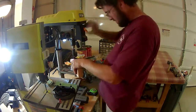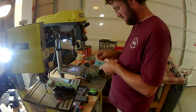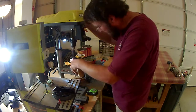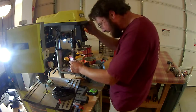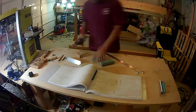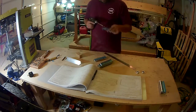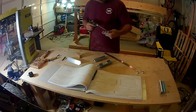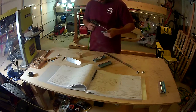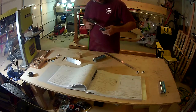As I was putting the ribs and skins together for the first time, it was a pain — not an easy go. The skins just did not want to wrap around the forward end of the ribs and it took a lot of manipulation. What I think I'm going to do when I get to the point of putting in pro seal is attach all the ribs in place, assemble the whole thing so the ribs are holding the form correctly, then take out one rib at a time, apply pro seal, click it back in place, then pull the cleco out for the next one. It's going to be a bit of a hassle given the limited working time with pro seal, but that's the only way I can see going forward.